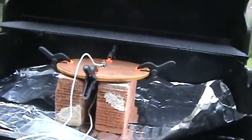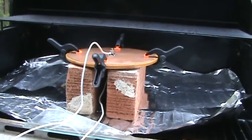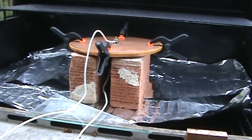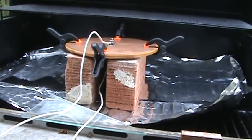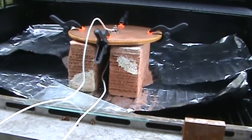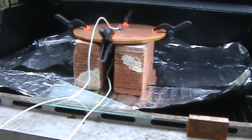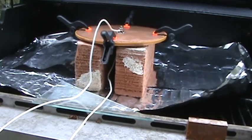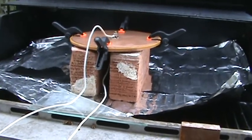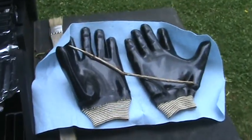Four clamps. The wax should melt and get soft at a much lower temperature than those clamps, hopefully. So we're ready to heat it up until the wax gets soft, and simultaneously be applying the power until the wax gets soft, which should be between — melting point is between 175 and 185 degrees Fahrenheit. We'll have to watch our temperature and watch the wax carefully, poke it with a stick every now and then.